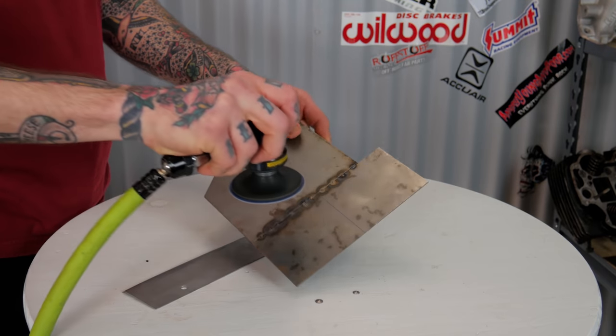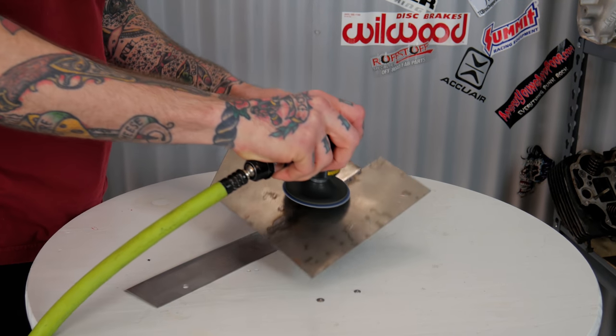There are various ways to go ahead and deburr your parts. I use a handheld belt sander, a pedestal-mounted belt sander, a right-angle die grinder, carbide burrs when I need to, a deburring tool. I also use a countersink bit — that's probably what I most commonly use on holes. Just knock down that edge, radius that edge, sand it down, make sure you don't have sharp edges on things. They're going to create problems down the road. Save yourself the trouble, save yourself the bloodshed — deburr your parts.